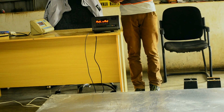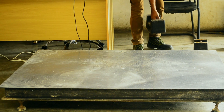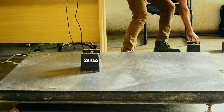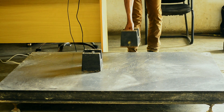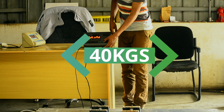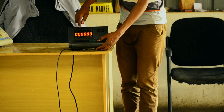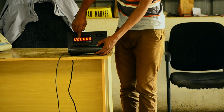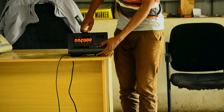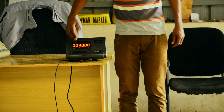It tells you add load. Now we add our load — for our case we have 40 kg. Therefore we put our load on. We have a load of 40 kg, then we press here. We now put in the capacity that we have by changing the position of the decimal point, and we enter 40 kg.